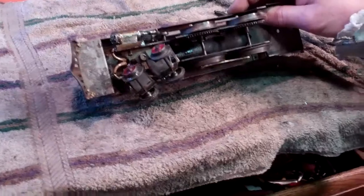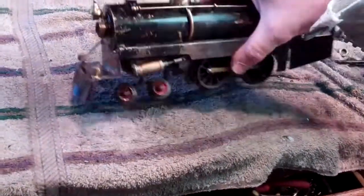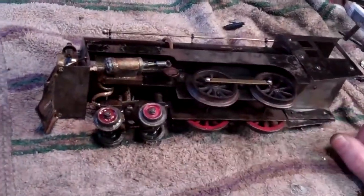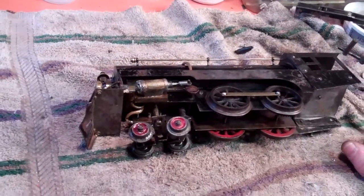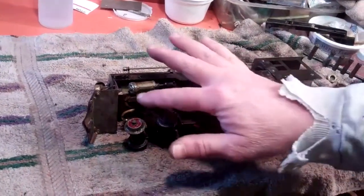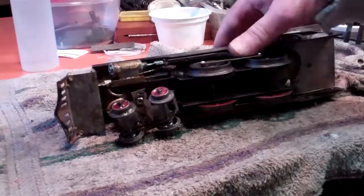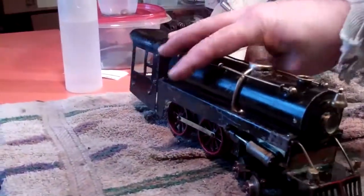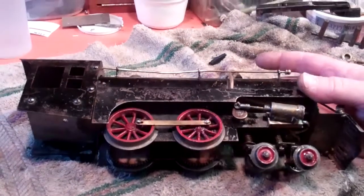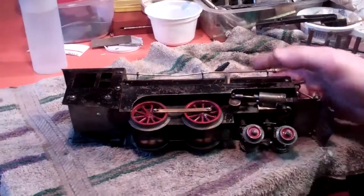It's also got a couple of little holes here in exhaust piping — I'm assuming that's to oil this thing, because it's a good way to get steam oil into the cylinders. This one was in really pretty good shape when I got it; it sort of ran but needed a quick going-through. I took the cylinders apart — all the gasket packing was shot — so I resealed the cylinders, reflattened the valve body and the mating edge of the piston assembly, lubed it, and replaced the steam feed to the cylinders because there was a big kink in it.